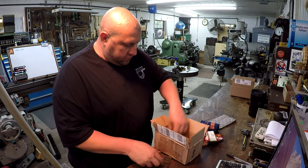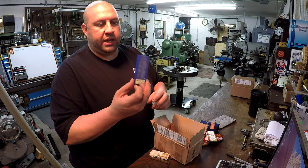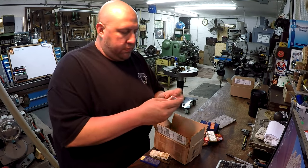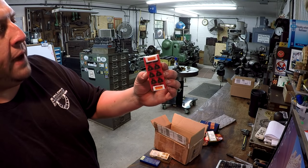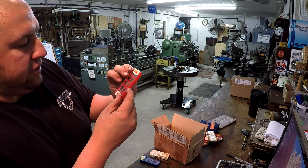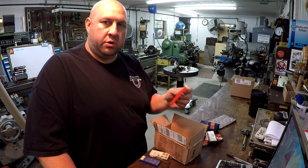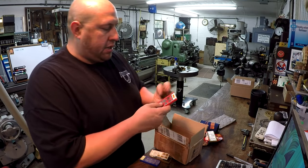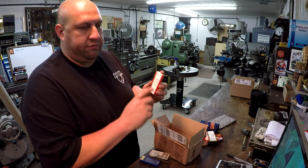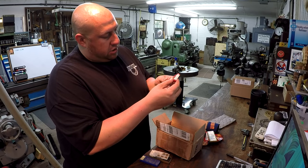And he gave me some round inserts for that round tool, and some of those little tiny inserts for that little boring bar, the little carbide bar. These are some Sumitomos. All right, there's some Sandvik, a brand new pack of Sandvik inserts, 4315s. I think that's that newer grade, the 4215s, that I tried before. I've actually been in contact with Sandvik recently, and they were going to send me some samples, and I believe they said the 4315 was the newer grade that they were going to send me a sample to try. So I believe that's some right there.